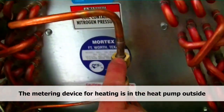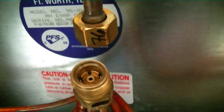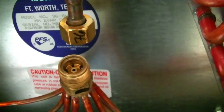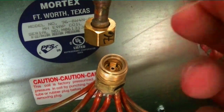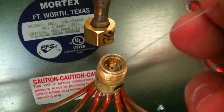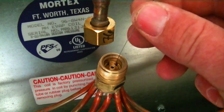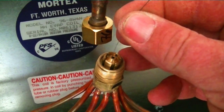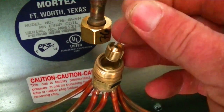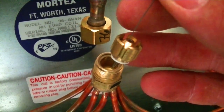You only get restricted flow during air conditioning, when liquid refrigerant flows through the piston. That's how we install the piston. I'll show you how to use that little wire to take one out. It's just a small hook on the end — you drop it through the center hole, drag it to the side, pull it up, and you have your piston out. Then you can remove it from the hook and drop it right back in.